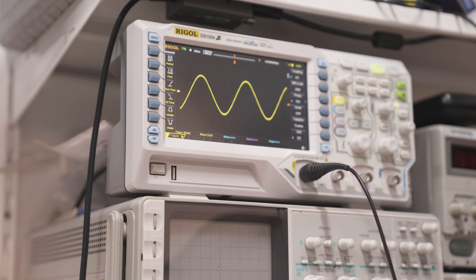If I push that higher, of course, getting up to about 14 volts all up, that's going to push us over that 22 watt range. That's at full absolute maximum tilt, which is a good thing. That means that this amp is in a pretty happy and healthy state, which is what we want to see.